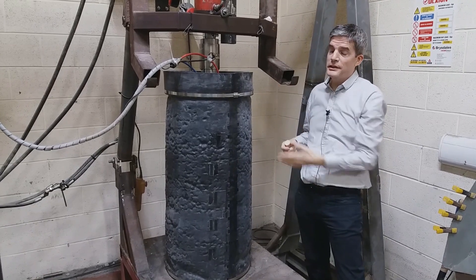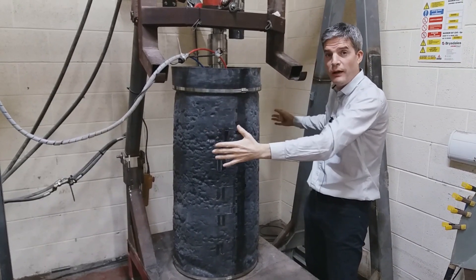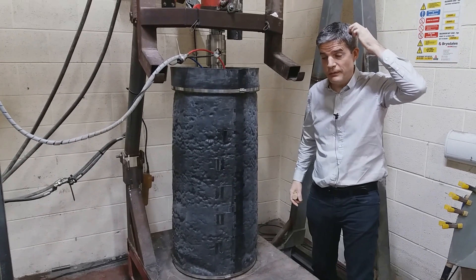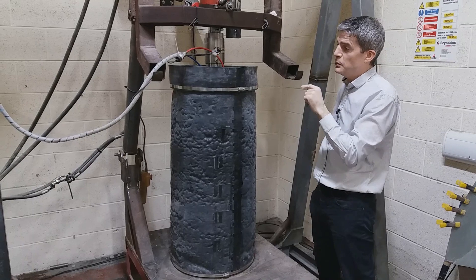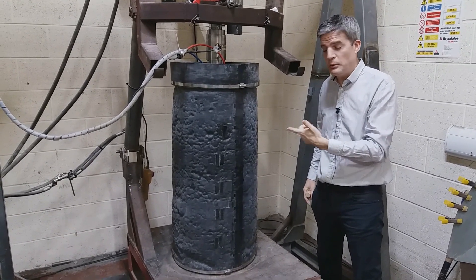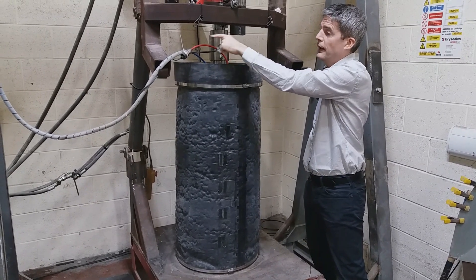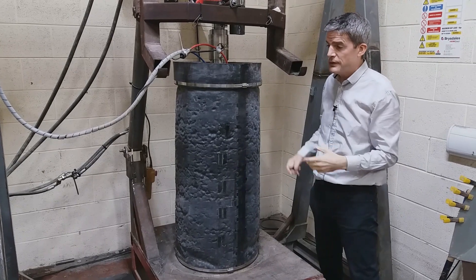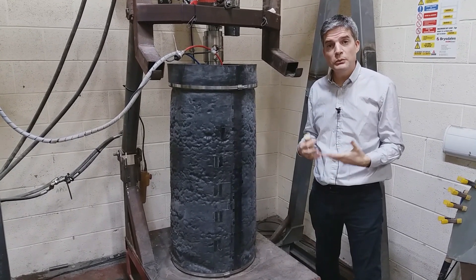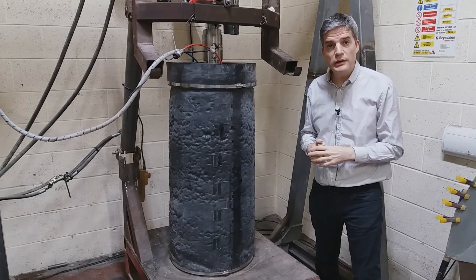Of course, when it's this big, we can't really place a large cell around the specimen to apply the confining stress — the cell pressure. So what we do is apply a vacuum. That's the noise you might be able to hear from the vacuum pump. There are pipes going from the top cap out to a vacuum pump, so we can get the confining stress up to about 80 kilopascals, which is plenty high enough for most of our applications, which are quite shallow.